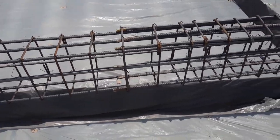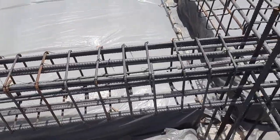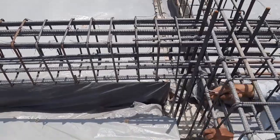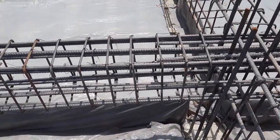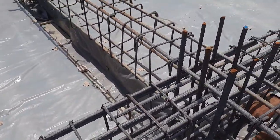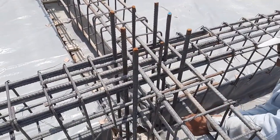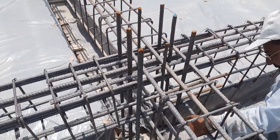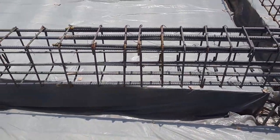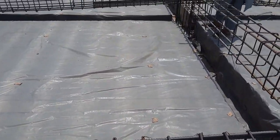When they fix the floor beam steel reinforcement, they place this beam inside the shuttering. The shuttering is placed below this beam, and they provide plastic on top to give a good result. The labor is working, fixing the stirrups with spacing of four to five inches. The column size is 18 by 18 inches, as you can see clearly.